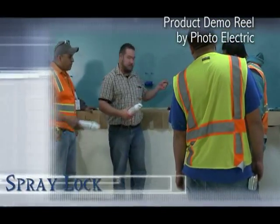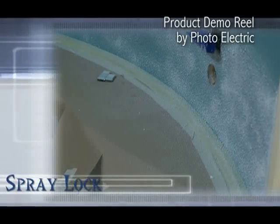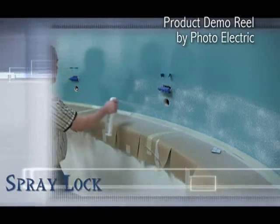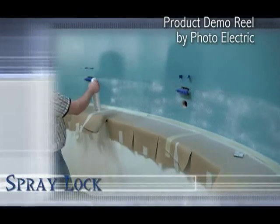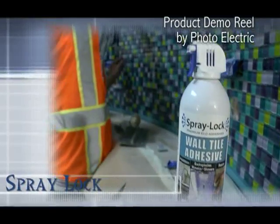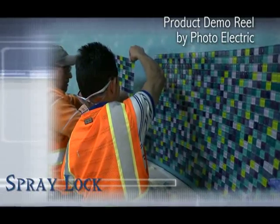Make sure the surface is thoroughly clean and dry and all adjacent walls are masked off to prevent the overspray from contaminating the surface. After the can is thoroughly shaken, pop the top. Holding the can 18 to 20 inches from the surface, work your way down the wall. Like spray paint, you want a good, even coat. Allow the SprayLock adhesive to sit for 10 minutes before applying the tile. Just press and hold. That's all there is to it.